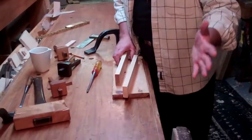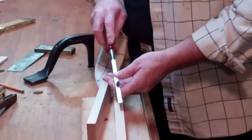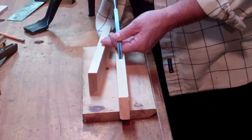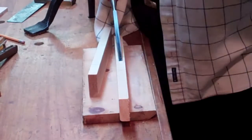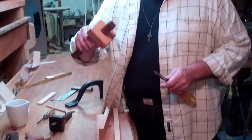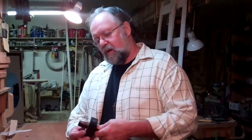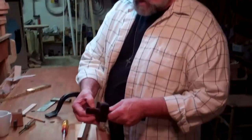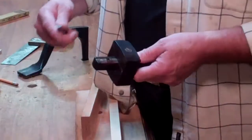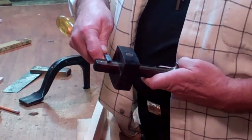We still need to find out where to put the hole. This is the piece we're going to put the mortise in. We're going to put the hole somewhere in the middle of the thickness, but we can't just start pounding — we've got to put in gauge lines. The easiest way is with a gauge. An ordinary marking gauge has one pin, makes one line. Much easier if you have a mortising gauge, which has two pins. It's adjustable — you can adjust the pins to fit different sized chisels, just have the chisel drop in between those points.